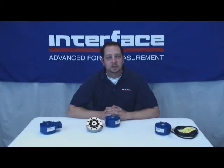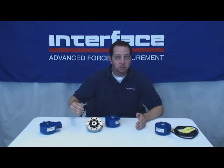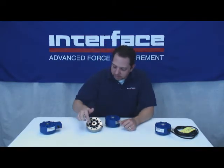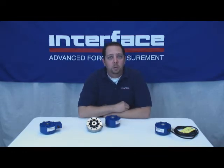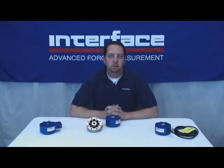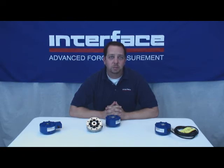Interface moment compensation is a process performed on all of our low-profile product family to guarantee minimal influence from off-axis loads. Each low-profile load cell undergoes a manufacturing stage where a weight is hung from a fixture, and as that weight is rotated around the load cell, signal output is kept within spec by removing material on shear beams as necessary. This means a precision load cell that will be insensitive to eccentric or off-axis loading. Great repeatability is also achieved by eliminating potential variance resulting from different installation orientations. Interface can spec low-profile eccentric performance because we test each unit we manufacture — we know how our load cells will perform.